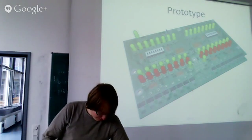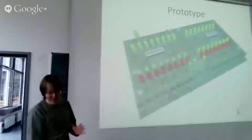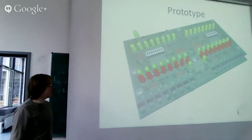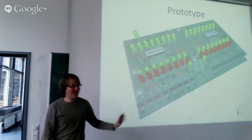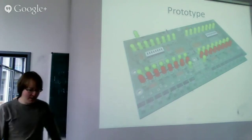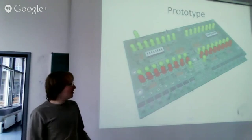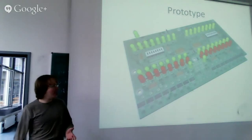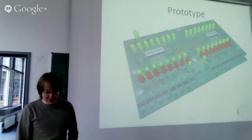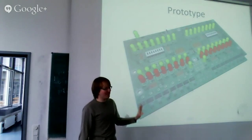So everything's working fine. I can control the automation systems, but there is one really big issue. As long as I do not touch it, it runs very nicely. But the problem is, it is normally running floating. It's connected to a 5-volt USB power supply, which is not connected to Earth ground. So when, while it's running, I connect an Ethernet cable or an HDMI cable, which is on the other side connected to ground, there will be something like an electrostatic discharge. It's very small, but it is sufficient to lose the complete internal state of this device.